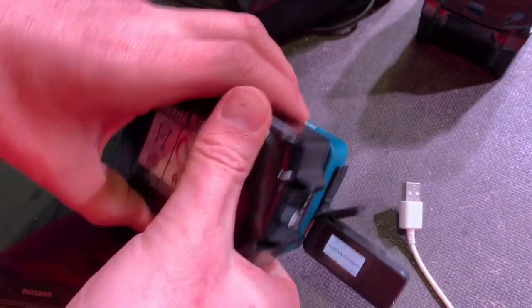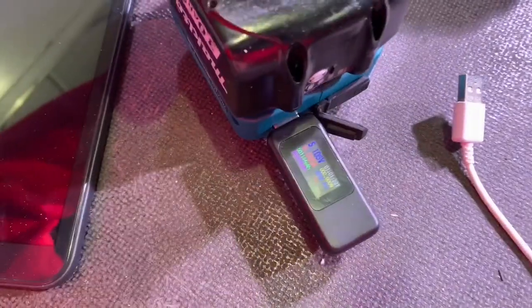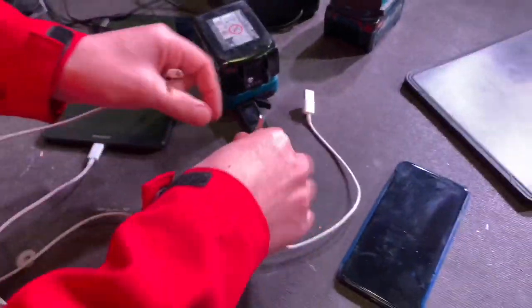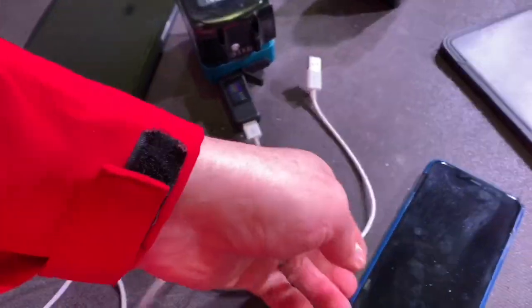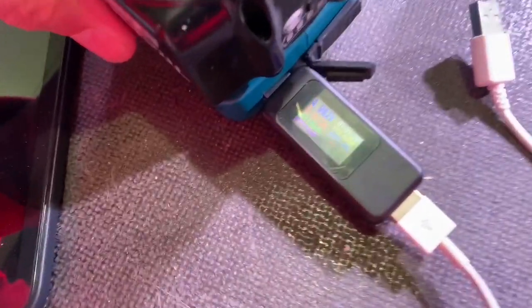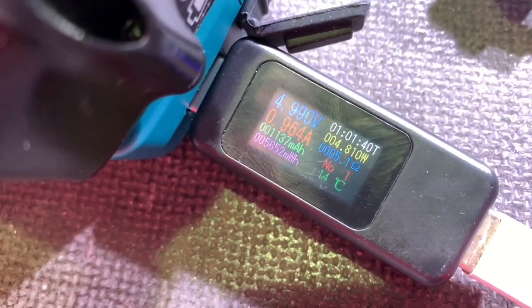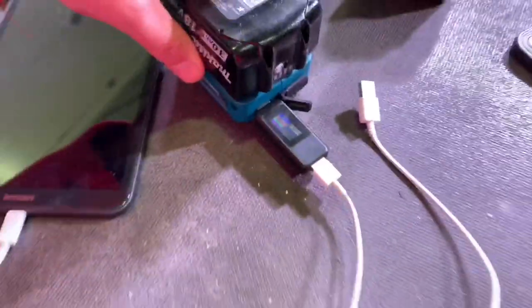So this is going to tell us what the adapter kicks out. Let's try it with some common devices. When USB charging, it's the device you're charging that tells the charger how much power to push out — it communicates between the two and then allows the power to flow. We've got an iPhone here — it's 73% charged. So it's charging, going up. It's drawing just under an amp, fluctuating around a bit. That's obviously the phone itself — it's nearly fully charged so the charge current is dropping.